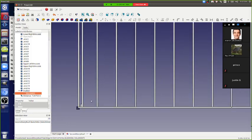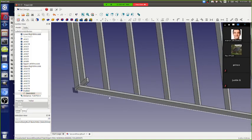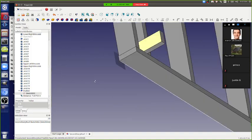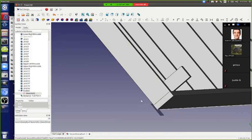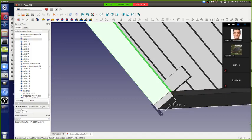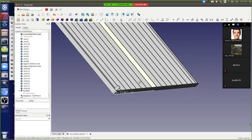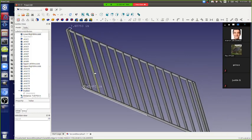Let's do the next one. So I'll upload this. Now let's see. How does that look from... Okay, so we didn't... Oh, I see. You got... I'm seeing like you got 2x6s. We need 2x12s here. Really? Yeah, we do. On all of it? Yeah, I missed that one. This upstairs, like 2x6s. You cannot do that kind of a long span with 2x6s. You need 2x12s.